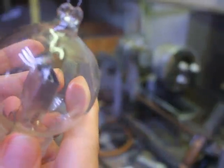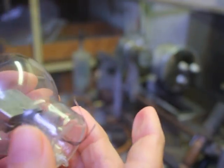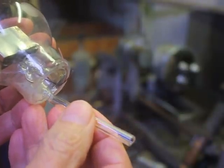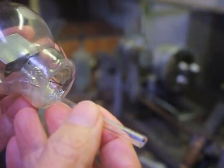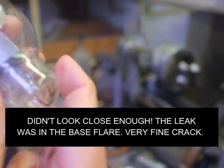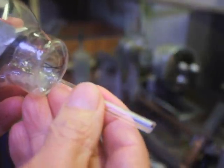What I'm going to try to do is see if we can find where it's leaking and see if it would be possible to just put a new filament in it and reuse it. But if it's one of the seals, then that won't work. The first thing I'm going to do is seal a stem onto the bottom of the tube so we can put it on the leak detector. I've inspected it and I don't see any cracks in the glass — sometimes there'll be a minute crack but I don't see any at all. So we'll put that stem on there and that will let us pull a vacuum and test it.